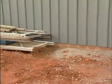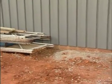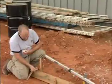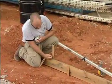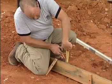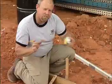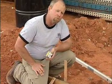What this pencil line represents is a level line with our benchmark, which is the elevation of the bottom of our building. So now what we'll do is determine how much slope or how much fall we want — in this case we want a minimum of one eighth inch to the foot — and we'll simply measure down from this level line the appropriate amount of slope. In this case we're right at about an inch and three quarters from the level line. So as you can see, this is a very effective tool.